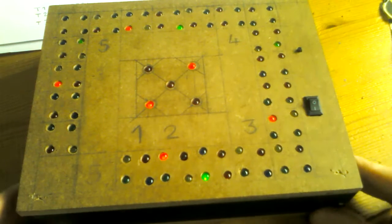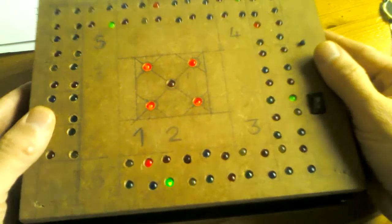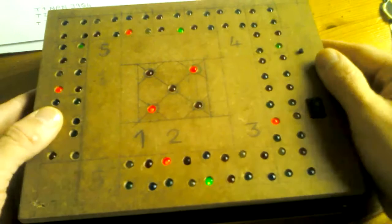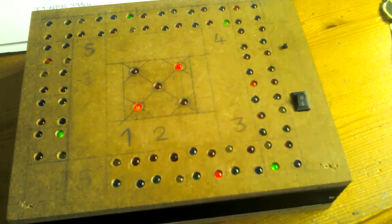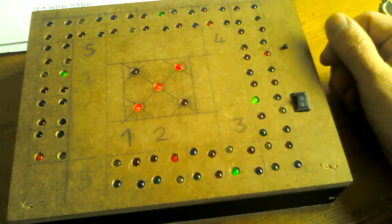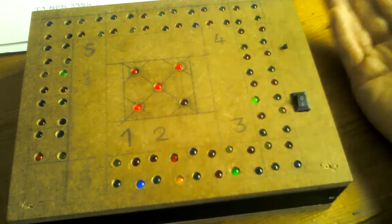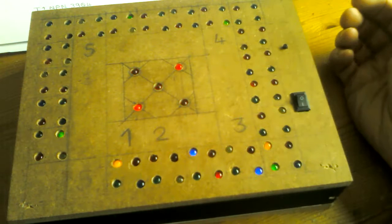the lights flash good now, except for the red LEDs, which I'm going to change the resistors for, to make them a bit brighter, because at the moment I can't remember what I've got in there, 15k, something like that. I think it's the red ones. I'm going to take it down, maybe lower than 10k, about 8 point something k. I got some resistors I think I'm going to try in there, but there we go, sounds like a dying cow.